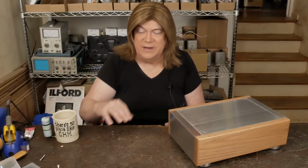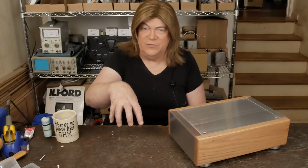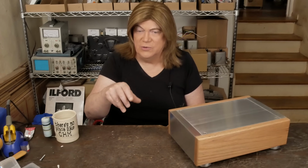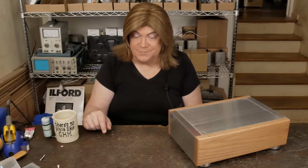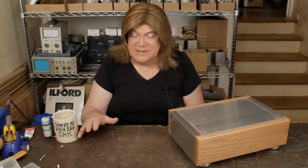We're going to have less than 10 milliamps in the front end, but I like having a little bit of headroom, right? So what would it cost to do 100 milliamps with one 5 volt 3 amp for the rectifier tube, one 2 amp 6.3 volt, and then one 7 volt 2 amp to do the heaters for the 300B tube, with the headroom to make an LDO regulator work? And he gave me a price. And honestly, it's probably about 60% of the cost of the stereo one.